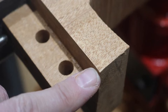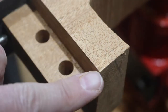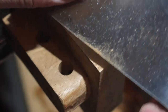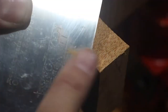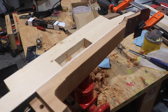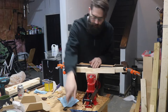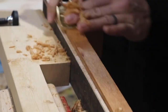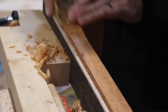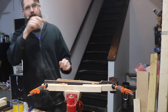I've managed to chip out the very corner of the heel, which means the heel isn't going to be as wide as I want it — I'll have to get past this chip-out on the corner. I think the card scraper caught the edge with its burr. I'm going to plane down past that until it levels out, then flip this over and do the same thing on the other side. It's going to take a while. It's been a couple of days — I finally got the sides even with the binding, just barely proud of it, and I'm using my scraper to get it smooth.